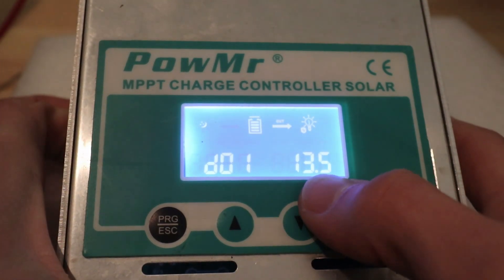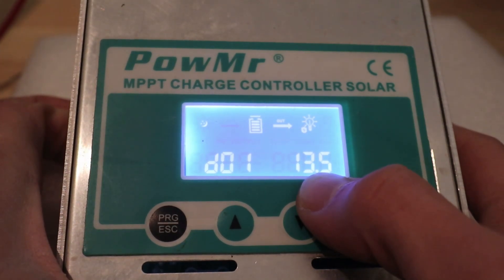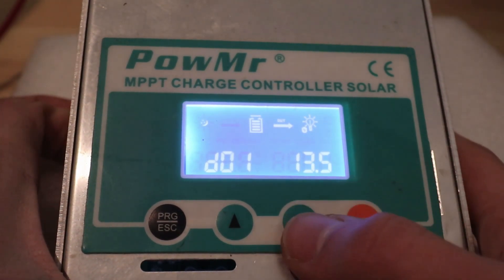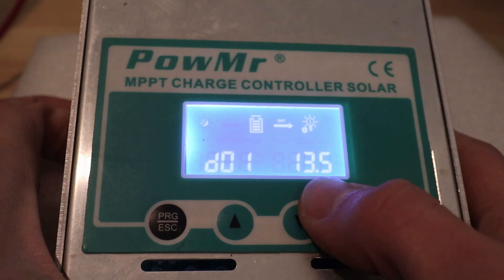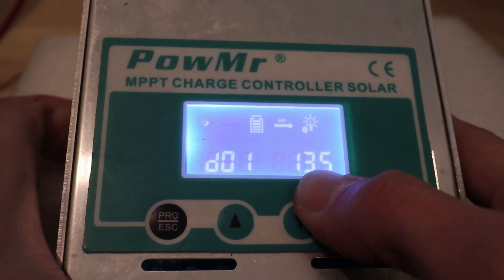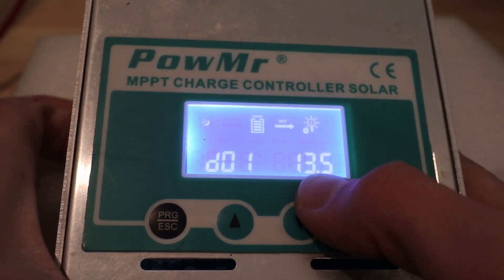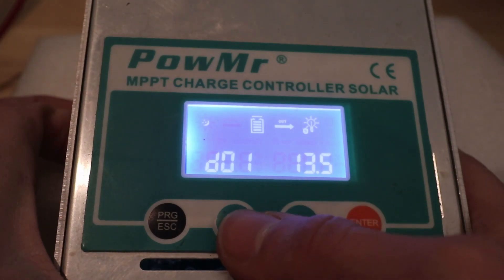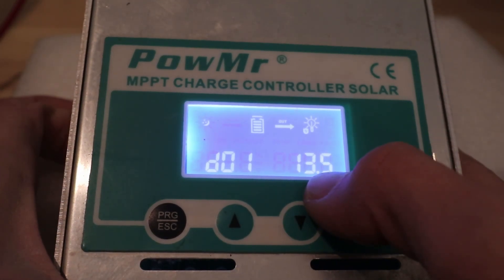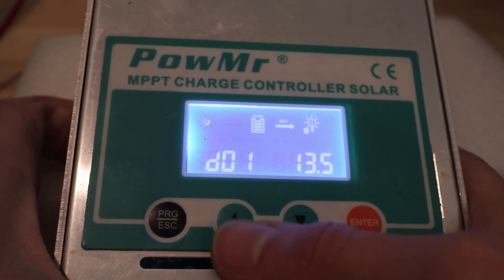When we get to D01, this is going to be your float voltage for your battery. When you're looking at your AGM, you should be able to look up the specs for what the voltage should be for float. When you set this, you should test it with a good multimeter and make sure that when it says 13 and a half volts here, you're actually getting 13 and a half volts at the battery. These are very inexpensive charge controllers, so you don't want to trust what's on the screen — you want to verify yourself. If you put 13.5 here and it's really doing 13.6, then maybe you should set this to 13.4 and move on from there.